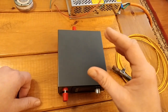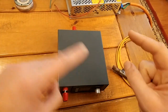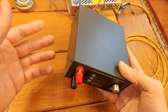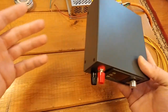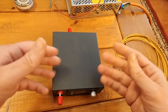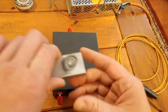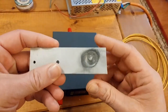ECM lets you add salt water to the mix and turn that purely electrical reaction into a chemical reaction, so you can do a lot more with a lot less power supply. This little 20-amp supply that costs 75 bucks all in — board, case, USB add-on, everything — will let me do roughly the same thing. Of course it's not going to be quite as nice or as fast, but I've actually already done a test and sure enough I can dig into some aluminum just using current and salt water.